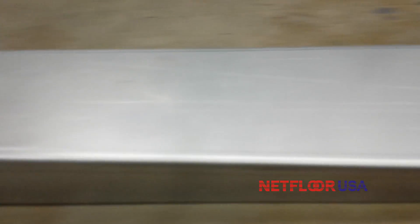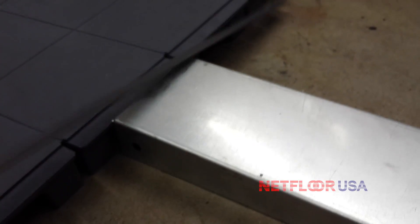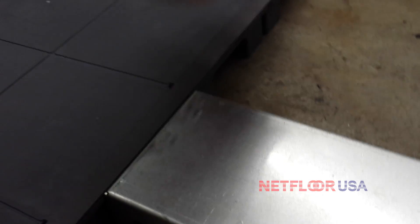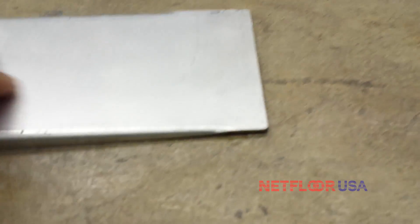However, with the four inch wide ramp section, if you flip it over there is not a very good contact patch on the bottom, so it's very hard to use any type of liquid adhesive. What we do is use gorilla tape. It sounds a little strange, but it works out quite well. We'll put our ramp sections down, put our sticky edge trimmer down, and then run gorilla tape at three spots: along the top to cover the threshold transition, across the middle, and along the bottom.